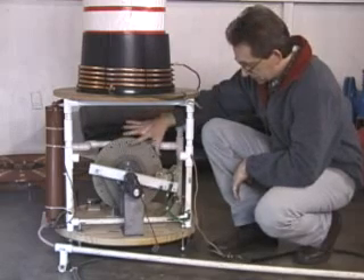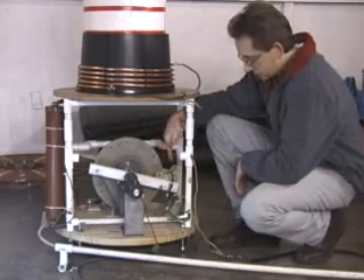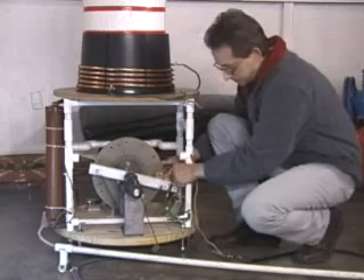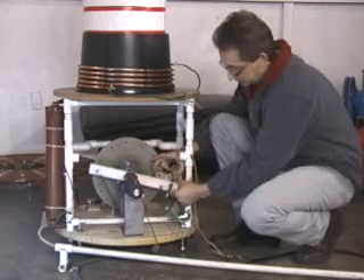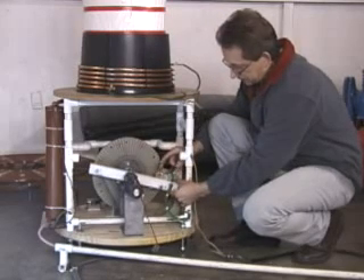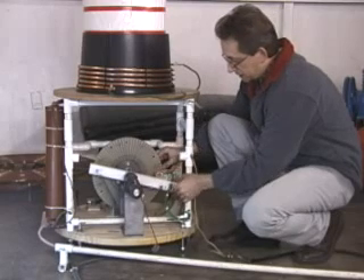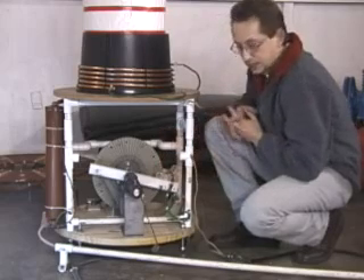That's basically the rotating section of this gap. The other section is the stationary electrodes, which are mounted on this arm, and the arm is attached to a motor and gearbox assembly. The stationary electrodes are set in brass stock on each side, and at the ends I have fittings so I can attach pure tungsten rod stock, again .375 inch diameter, and I can adjust the gap at each side of the stationary for wherever I need it.